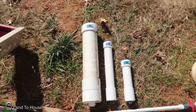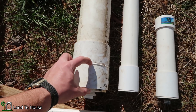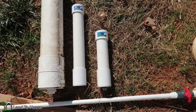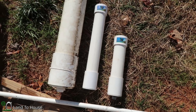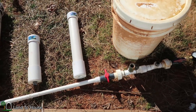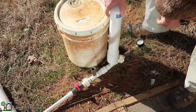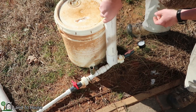I have three different size pressure tanks here. This one is a 4 inch pipe by 20 inches tall plus 4 inches or so extra — a good size. Next we have the tank that I typically ship with these ram pumps, and that is a 2 inch pipe at 15 inches long. And lastly we have this little test pipe that I used with the 3/8 inch pump, so it's definitely a good bit smaller.